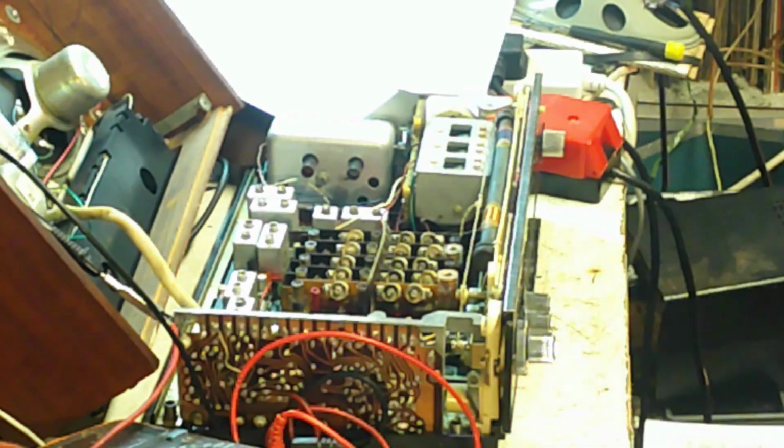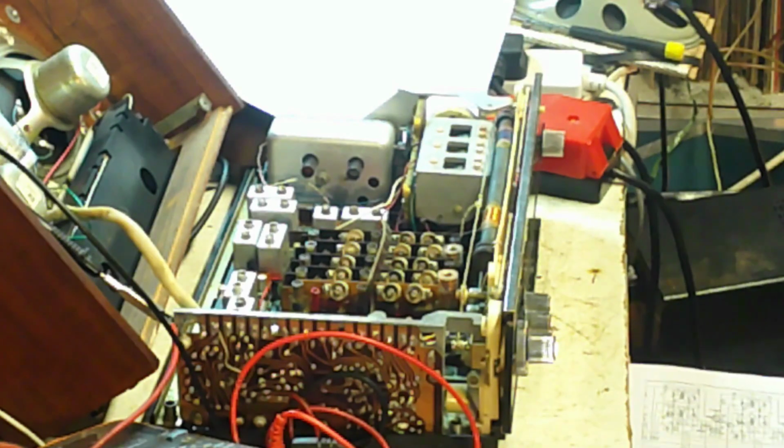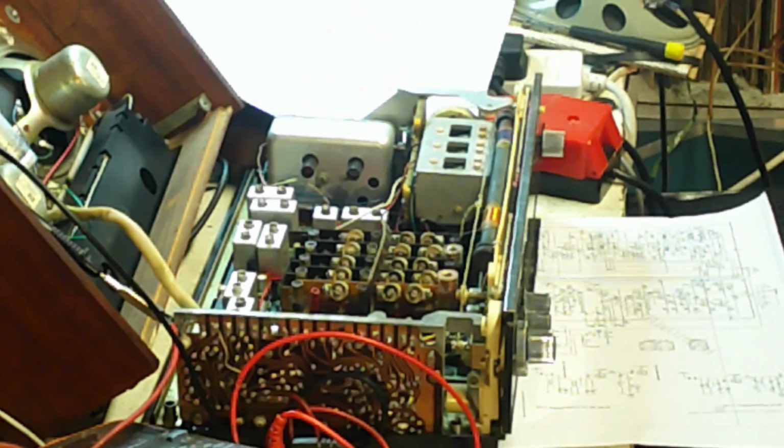Now, with a set like this that's foreign and about 1970 or so, you need to look at which way it's wired for two reasons. One, Russian sets, and some hackers actually, tend to have, shall we say, interesting ways of doing things. So that has to be taken into account. And on top of that, normally you'd think that red was positive, and in this case green was negative. Not always the case. Don't ever go straight off colours, because it might not be true.